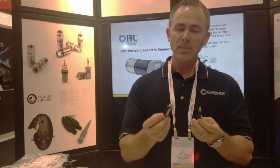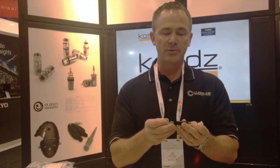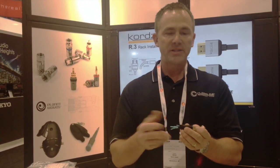Coupled with that, we're also showing a new HDMI balun set from Clearline. These do 4K at a little over 300 meters, require a single multi-mode or single-mode fiber, and it is an LC type. The connection is very easy and solves all the distance problems you'd typically have with copper. And if you're running fiber and using these, it's 4K right now — when it becomes 8K, you just unplug and plug in the new set, because everything's moving to fiber.